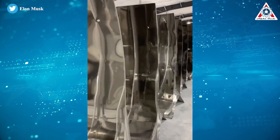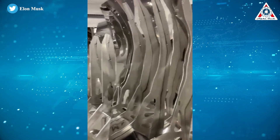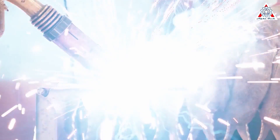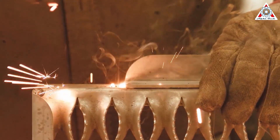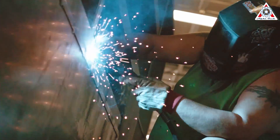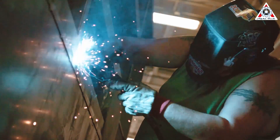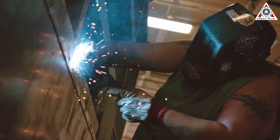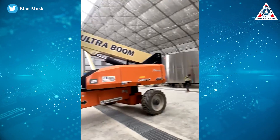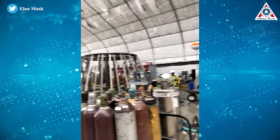This dual shield method is preferred for welding thicker material or for out-of-position welding. When used in identical settings, it delivers welds with more consistent mechanical properties and with fewer defects than other processes. The continuously fed tubular electrode also allows for higher production rates than solid wire or stick electrodes. However, the gas-shielded method may not be suitable for use in windy conditions, as the disturbance to gas shielding could result in reduced weld metal properties.